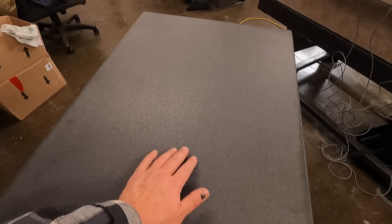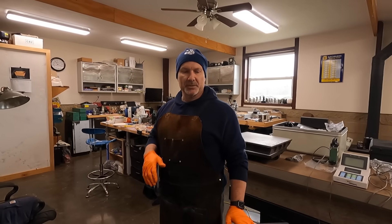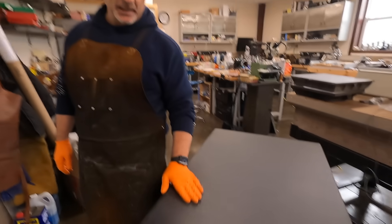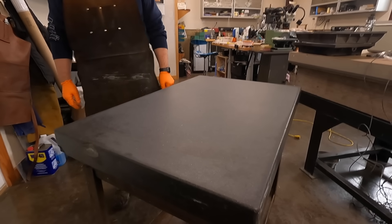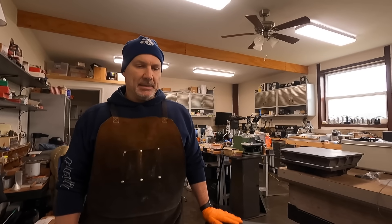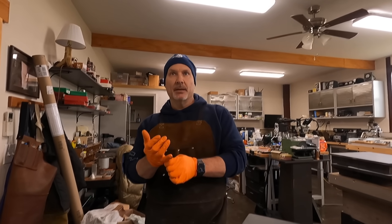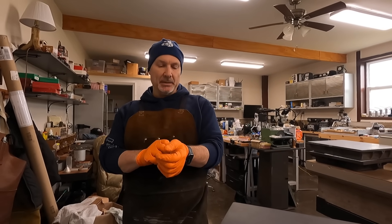I'm going to gingerly go back over the plate again with the lap, and we'll wash it real good and let it dry overnight, then come back and read it again in the morning. I'm going to try to take it down even further and get these couple of little low spots. I think if we get this down to 150 millionths — a tenth and a half or less — and with the repeatability under 50 millionths, you'll have an A plate. A good solid A plate. If you want to try to achieve double-A numbers we can, but we'll see.